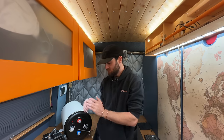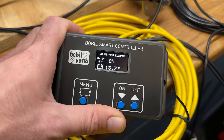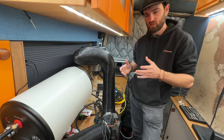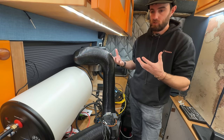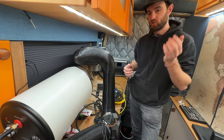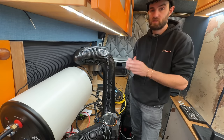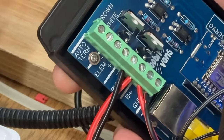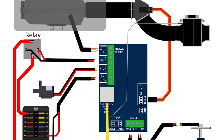I've artificially turned on the hot water element by changing the power supply voltage to 13.7V, and it's doing its 300-second countdown before turning on. The DC water heating element is now on. When it's on it doesn't run the circulation pump, so test data won't be fully accurate due to stratification, but that is a 200W DC element. The reason you might want to use a DC element is as a solar dump load — opposed to having unyielded energy from solar when batteries are nearly full, it automatically turns on to use that energy. Do remember the element switches are not for running the element directly — that's what the 40 amp relay is for; the ports here just send a signal for the relay to turn on and off.